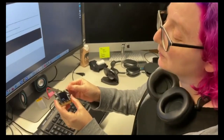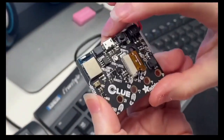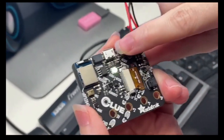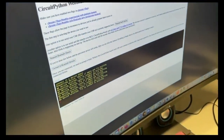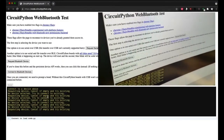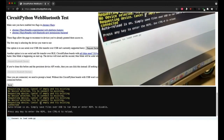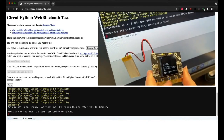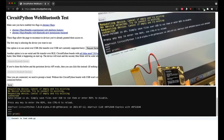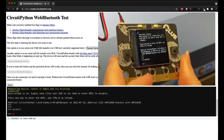Hey Lydia, what is this? Let's show how you can use Web Bluetooth to wirelessly program Circuit Playground boards with NRF52840 native Bluetooth. So press reset, and then press again when it's blinking to put it into Bluetooth mode, and then request the device, pair it, and now that we're connected, you see the REPL here? It's the same REPL here. As I type in this REPL, this one echoes, so I can print stuff, and it appears on the display.